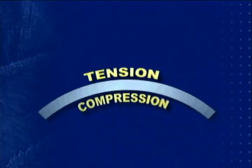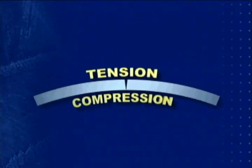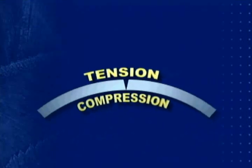If a metal is bombarded sufficiently to indent the surface, a residual compressive stress is induced in the surface. When a metal bar is flexed a sufficient number of times it will eventually start to crack from metal fatigue on the side where the metal is being stretched in tension. However, a crack will not occur on the opposite side which is being pushed together in compression.